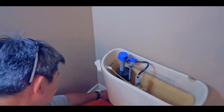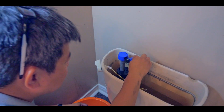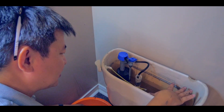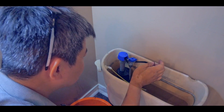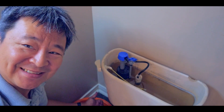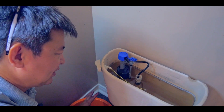This one adjusts the amount of water coming in — I can turn it down or speed it up. This one allows me to adjust the level of the reservoir. I could make it less. Now you can see I can adjust a bit more, add more. It works really well. Awesome, so it works. It is the fill valve problem and I was able to fix it. Now I just need to clean up, dry everything, and make sure there's no leak, and we're ready to go.